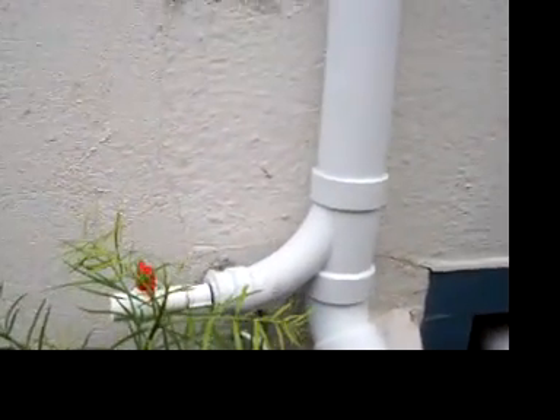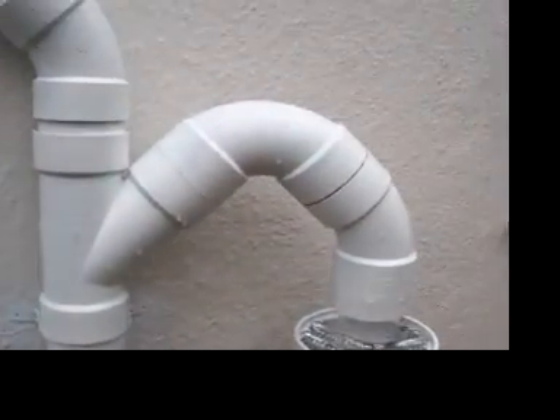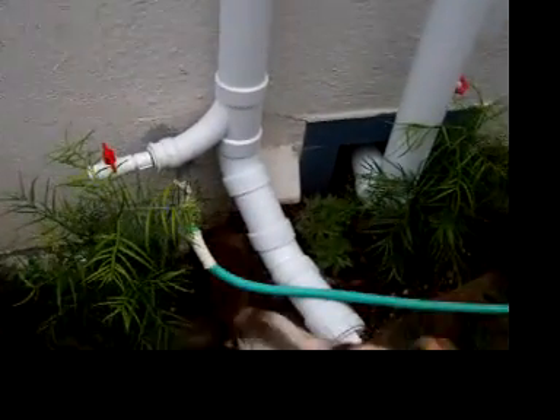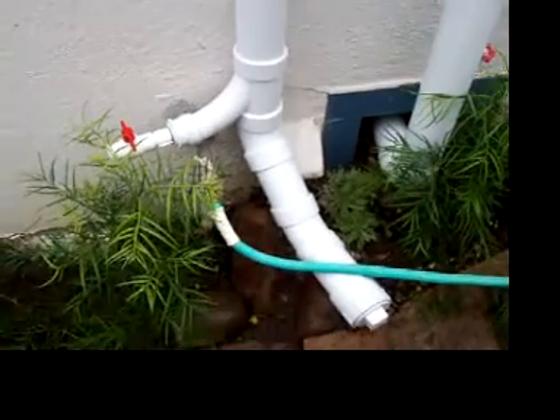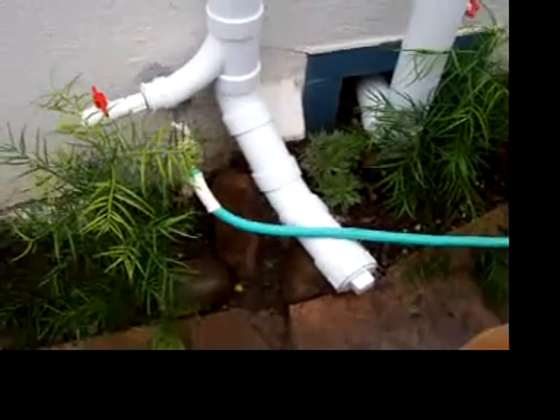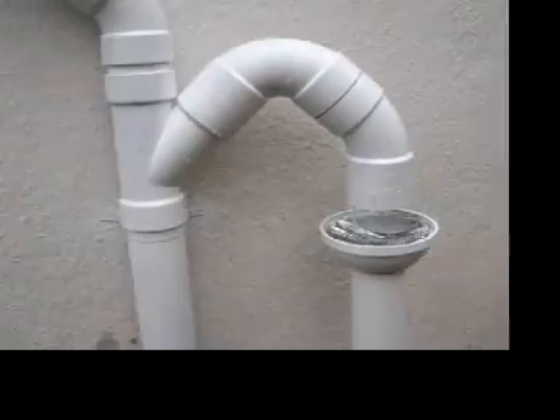When I plug it like it is now, the water backs up, and there's a little spout I put on there for the excess water. The water backs up and then overflows into that pipe. The concept is all the heavy stuff — the debris and asphalt and little stones from the roof — stay down there, and all the good clean water floats up and overflows into there.